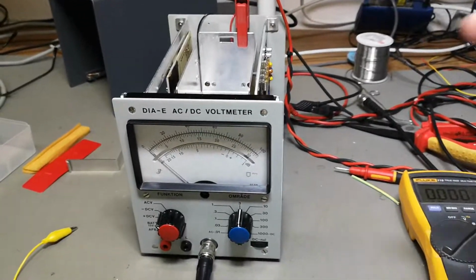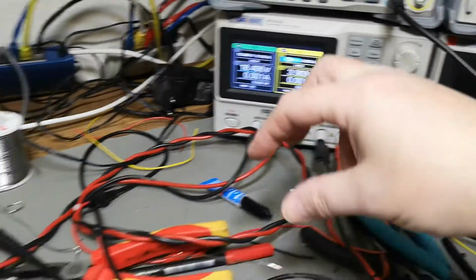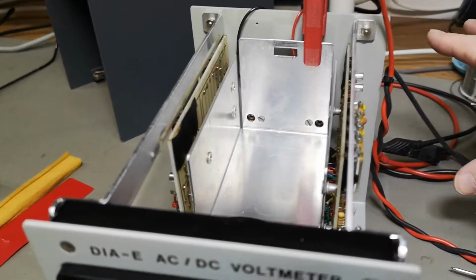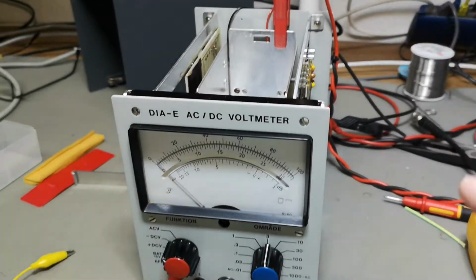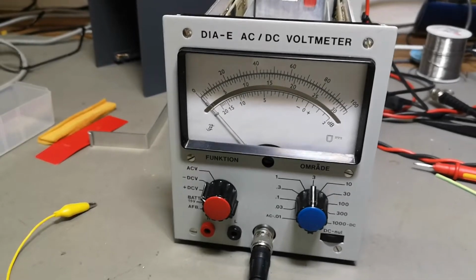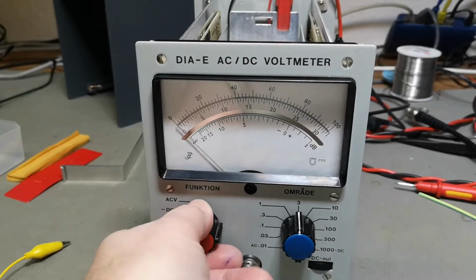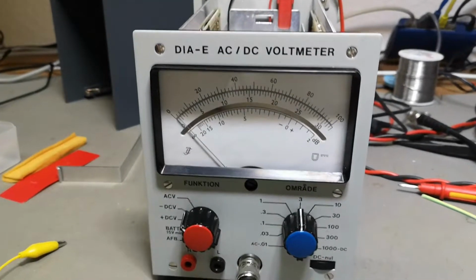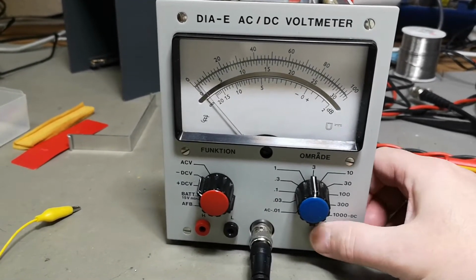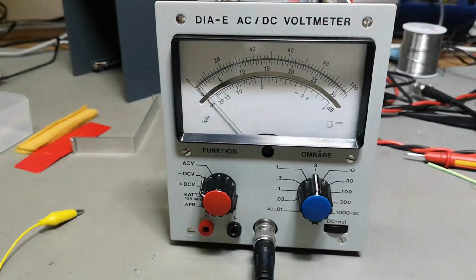So that's actually interesting. I got now a second power supply, and that is now my chassis to ground offset. So I can pull this. So now I got 3.9 volts, and look at that. It's almost 0. And it is indeed responding a little bit to my 0. More or less how much I would expect this to be. Very, very little, obviously, right?